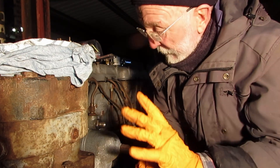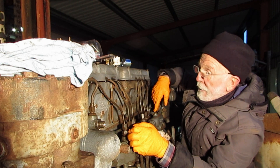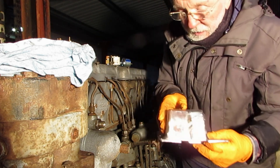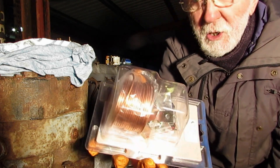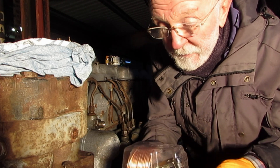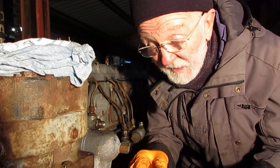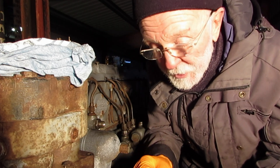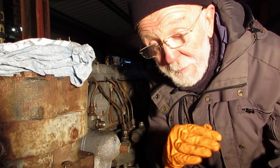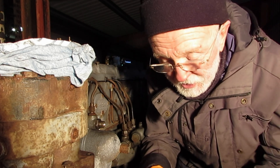They give no bother at all. All you have to do is join the pipe from anywhere on the manifold to that gauge and it measures the oil pressure. Now a couple of considerations. This is a modern one — you'll get some idea of the diameter of the copper pipe. Generally we use copper because it's very easy to bend around corners and it doesn't corrode. The copper pipe doesn't need to be a very large diameter — in fact the smaller it is the better, because the less oil you'll lose should the pipe break. It'll come out slowly enough to give you time to stop the engine and take emergency action.